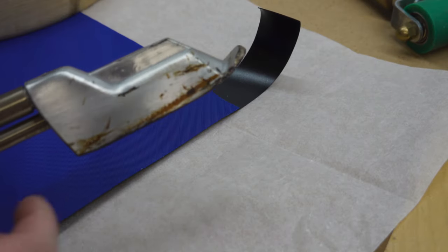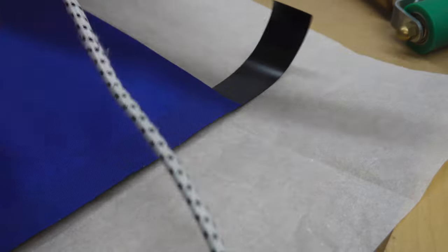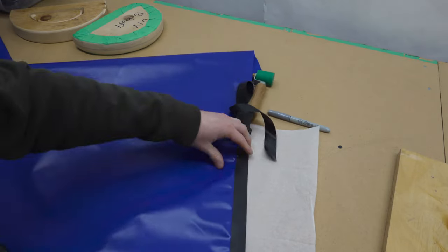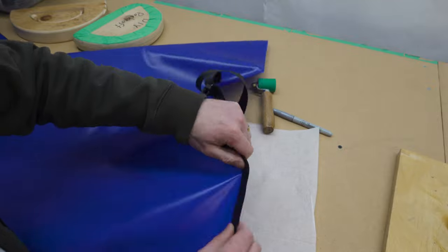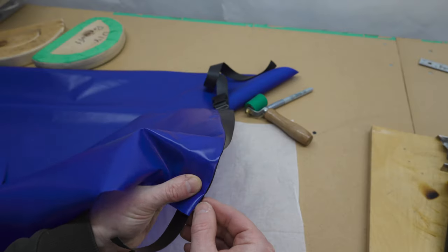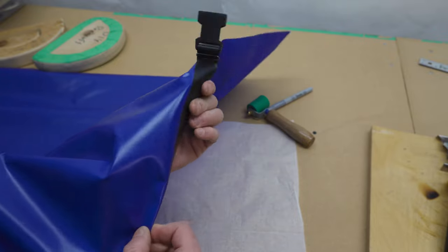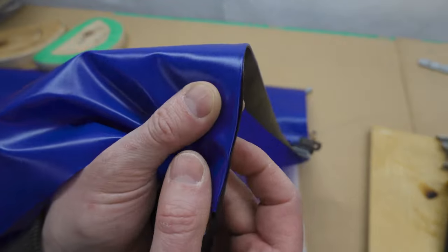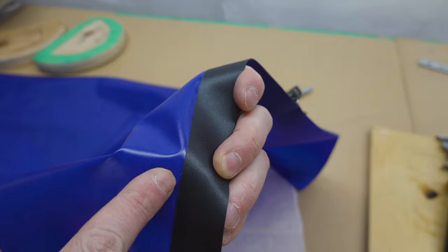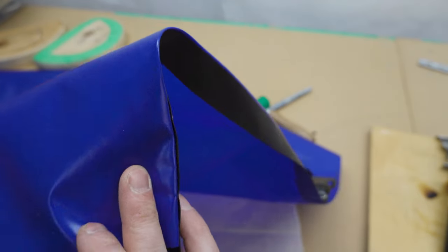When I get to the end, because the iron curves up at the tip, you can either use the iron that way or, if it's more convenient, go like this lining it up with the end. Let's flip it over and take a look. Manipulate it, make sure it's not lifting or peeling anywhere, run your fingernail along the edge. I can see that I didn't weld all the way to the edge of this strip in this little section here — the rest of it looks pretty good. So I'll go over this area again. It's better to have the iron overlap a little bit and melt a little bit of the TPU beyond the edge of the strip — if you leave things hanging out they can get caught and start to peel.